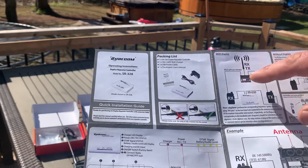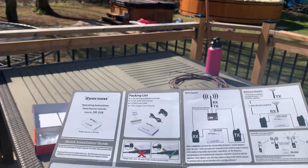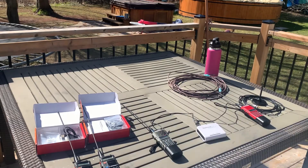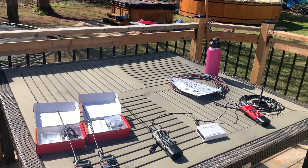As the installation manual shows, in duplex mode you have an RX unit and a TX unit, and you can either install a duplexer — which in this situation we don't have — or without a duplexer the manufacturer recommends one to five meters of separation, roughly three to fifteen or sixteen feet. I experimented by separating the units as much as I could and also extending the antenna with a Nagoya UT-72 mag mount, giving me about four to five meters of separation between the two units.